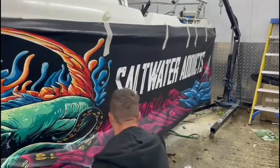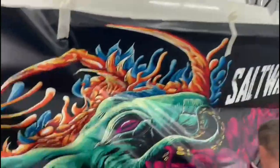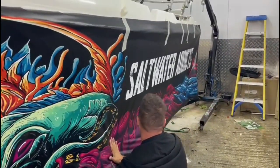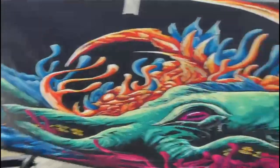At this stage we're just pulling the wrap away from the boat and stretching it down. We don't want any creases or anything like that, so just keep pulling it. Effectively try and glass the film out with the contours of the boat as you go. You've just got to keep stretching it.